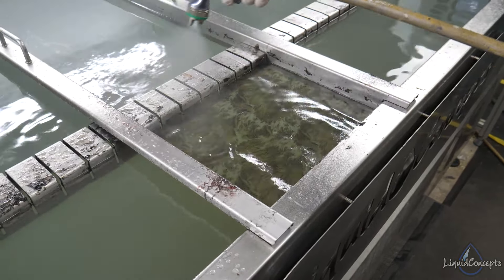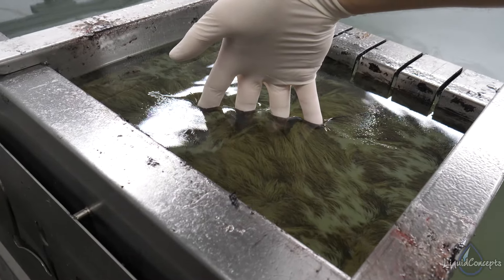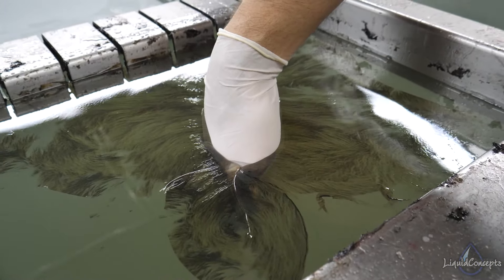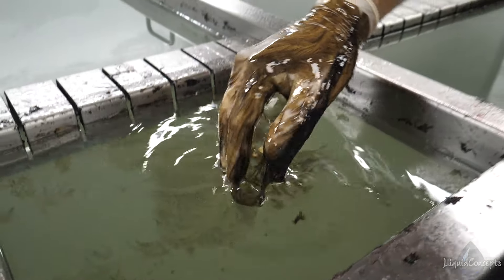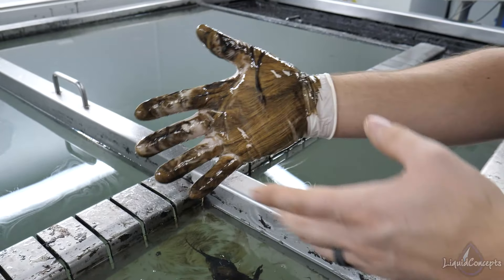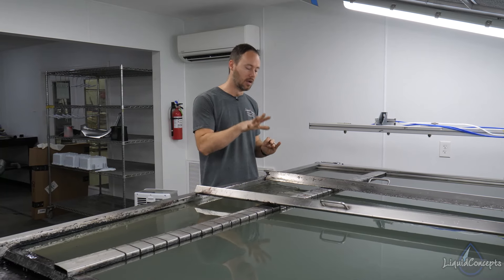Now that we've got this already sprayed, we're going to dip instantly. You'll notice it's still acting like paper going down into the water. We do not have a really glassed-out look. It is stretching, but it still has a lot of wrinkles all the way around in the pattern, which is not what we want. We've got a lot of excess through here, not great coverage, and as you saw it wrinkled more like paper.